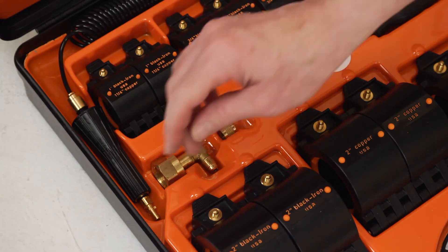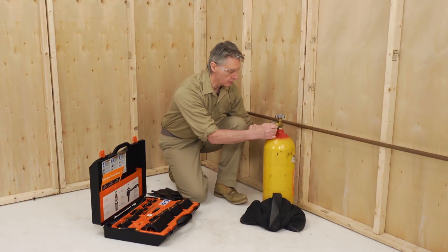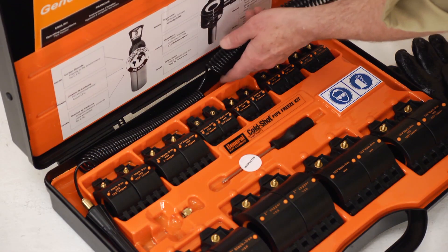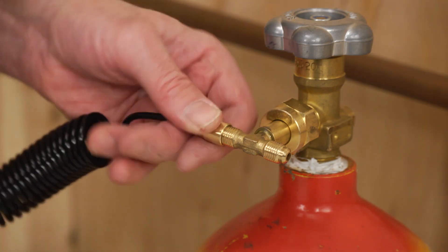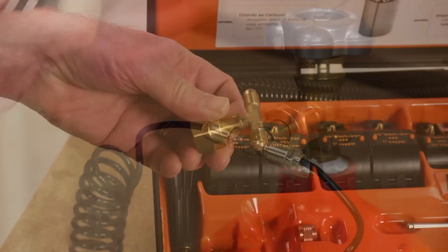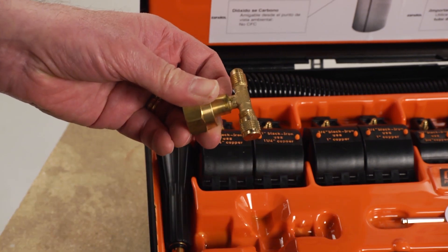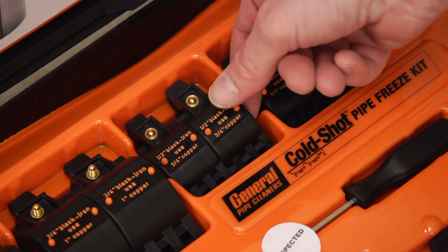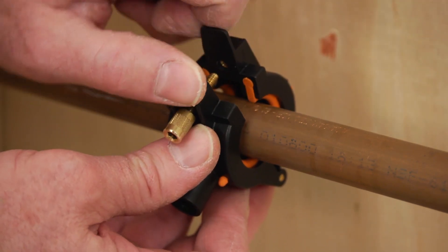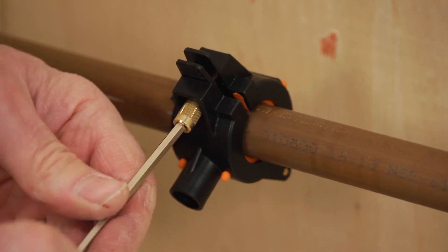Secure the cylinder to prevent it from falling over. Screw the T-distributor onto the cylinder using a right-hand thread and secure with a wrench. Screw the spiral hoses onto the T-distributor. If only one freeze head is needed, use the locking nut to close off the other half of the T-distributor. Choose the freeze head that corresponds to the size of the pipe to be frozen. Place the freeze head on the pipe and secure it by tightening the knob evenly using the hex wrench provided, for a firm but not over-tight hold.